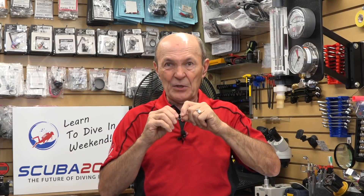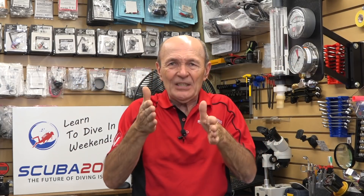There are several C-clips in most scuba regulators — there's one for sure that holds the filter in. Almost all regulators use a C-clip to hold the filter in, and that's critical. Other places are even more critical. C-clips actually do have a top and bottom. If you look at them quickly, you don't notice, and some service people will just say 'C-clip, yeah, that goes in there' and forget about it. C-clips have a top and a bottom because they are punched out of metal — it's spring steel. They go through a punch, a machine. Millions of these are made because they're replaced every time you service anything; you always replace a C-clip as they lose their spring. The punch comes down and pushes the C-clip metal into a die. When it does that, the bottom of that sheet of metal gets a little curve on it; the top is perfectly flat.